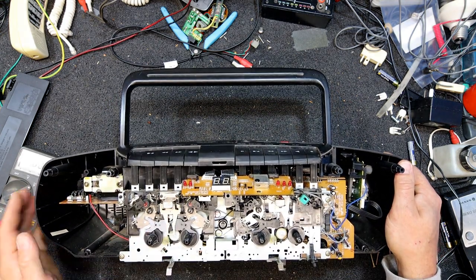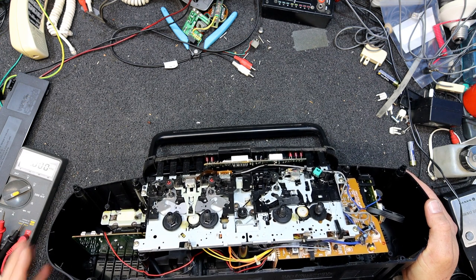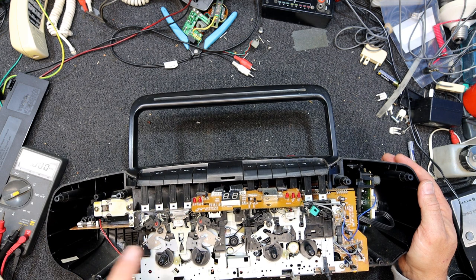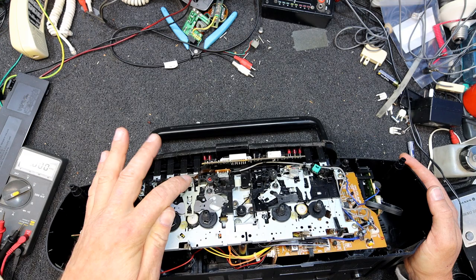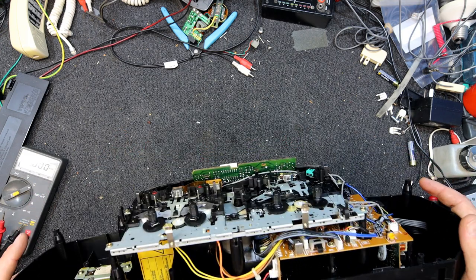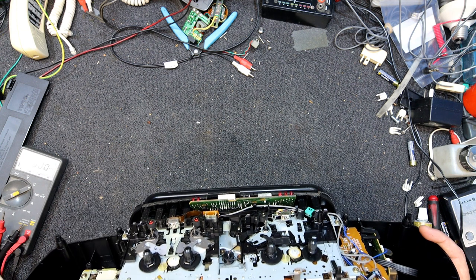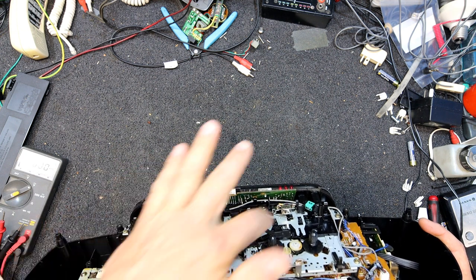We've got a fixed head. I actually had a feeling these had rotating heads. I'll have to double check that. Some of these Tanashin mechs come with either, they call them different mechanisms, but the whole mechanism is basically the same, but either the head is a dual car cassette one like that one, where you've got the two faces, one for each direction, compared to the single face on that one, and the other side is just metal.